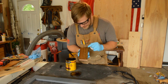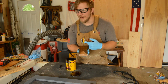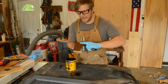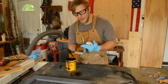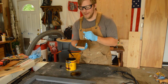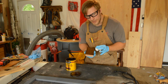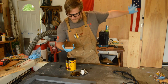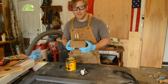Oak is really notorious — especially red oak — for having a lot of free spaces to fill in, so it might be a good idea to either use a pre-stain or a wash coat, which is basically a wood putty mixture that you push into the cells of the red oak, then sand it back, giving you less space to fill. Personally I like the open-grain look of oak, so I'm not going to use a wash coat for this. That looks pretty good — I'll put this outside, away from the sanding that's about to commence, and let's prep all the parts.